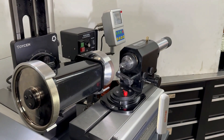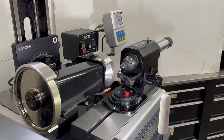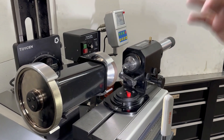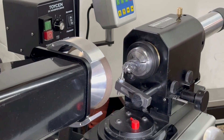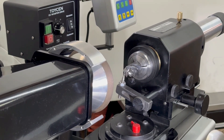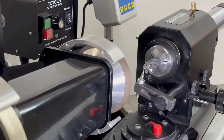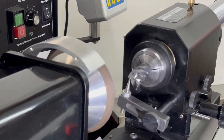You want to experiment with it a little bit. You just have to observe the basics. The primary and secondary angles should be close to factory. You want to have a very good finish because carbide becomes fragile when the finish is not good. You want to make sure the corners are perfect and that all the flute lengths are the same. In this case, this is a variable pitch tool.